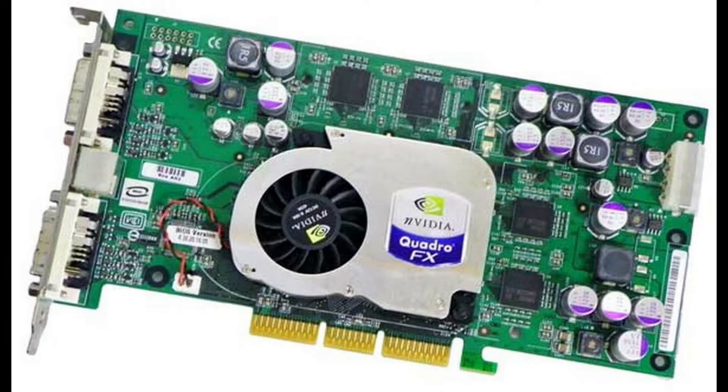So this time we're not skimping out on anything. What we are actually skimping out on is 25 megahertz on the core and the RAM. However, the core is still the same as what's in a 5800 Ultra. So with a beefier cooling solution and a little bit more voltage, you should have no problem running at 500 megahertz like a 5800 Ultra, or even 400 megahertz as a 5800. And this kind of goes for the RAM as well.